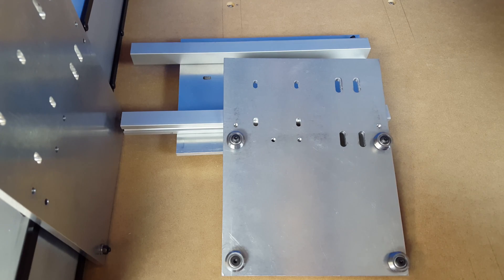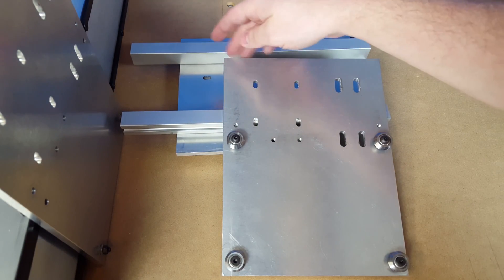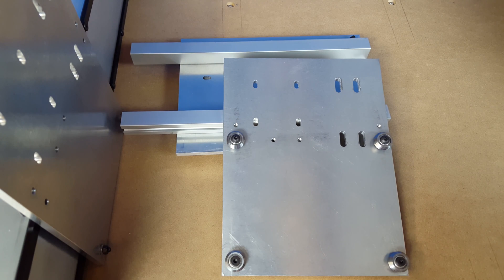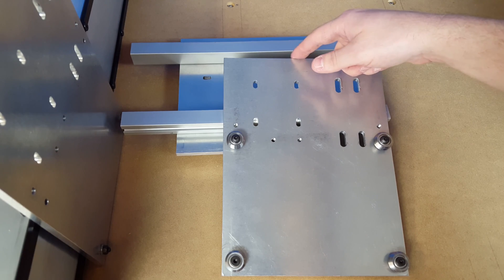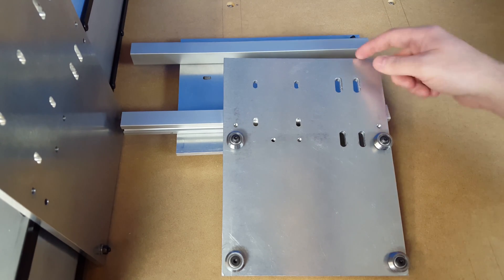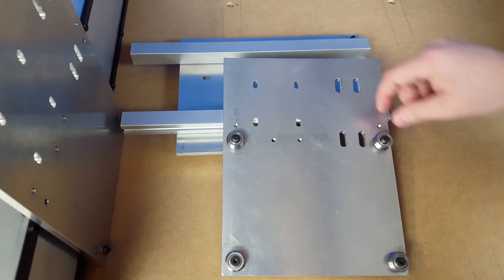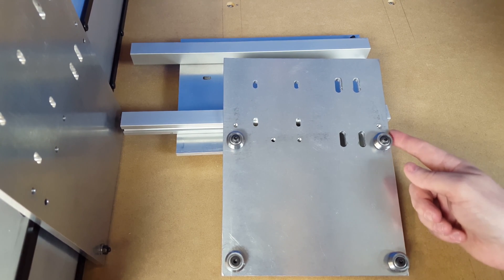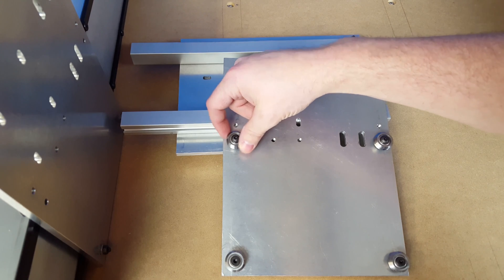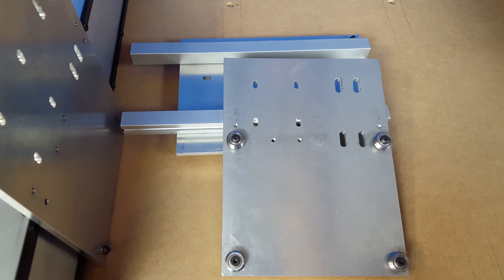The last thing that needs to be dealt with is I need to mill this side right here square with everything else. For some reason when these plates came to me, this edge and this edge were both perpendicular with each other, and this one was square to them, but this one right here was a little bit off. It's actually a little bit wider than it was supposed to be because as you can see right here, the wheel is almost flush with the edge, and over here we have quite a bit of material still.